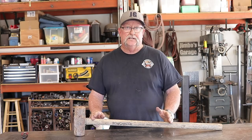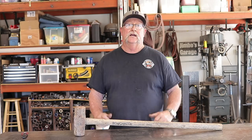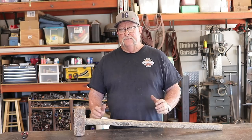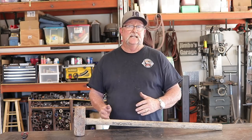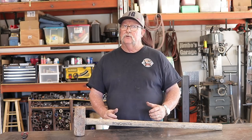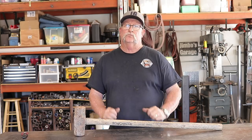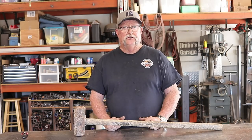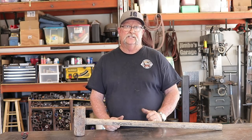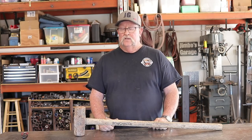What I have in the concrete industry is a sledgehammer, and this is what we use to drive wood and metal stakes into the ground to set forms. Typically it's a six to eight pound hammer, although they're available in six, eight, ten, and twelve pound versions. Six to eight pound hammers are ideal weight-wise but the heads are a little too small. Ten and twelve pound hammers are a little too heavy — they'll wear you out swinging them all day — but the heads on them are much larger and give you a nice surface to work with.